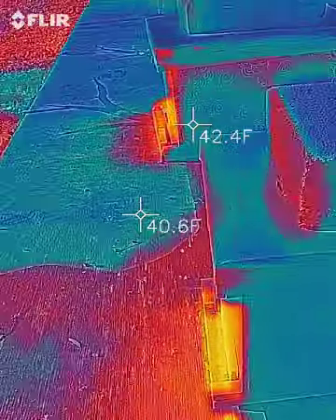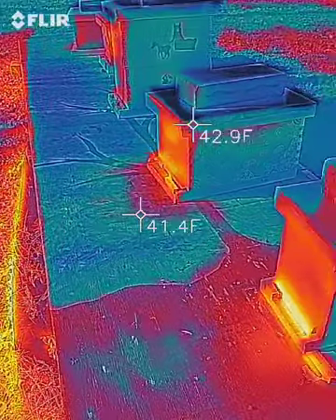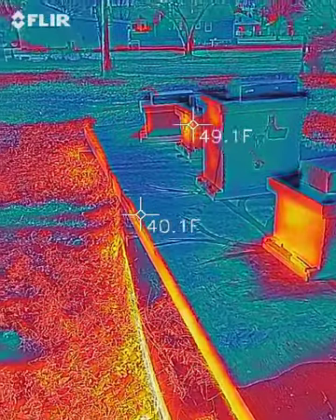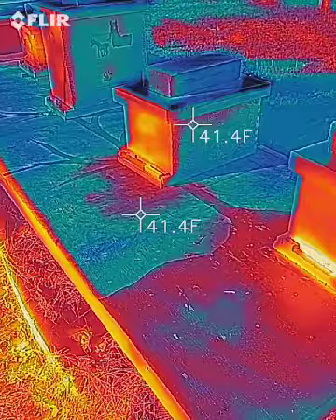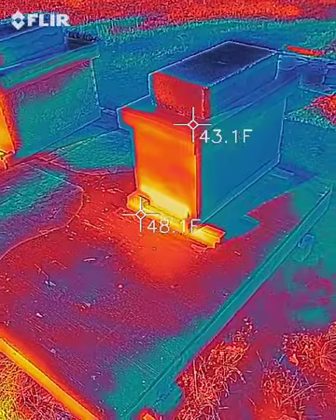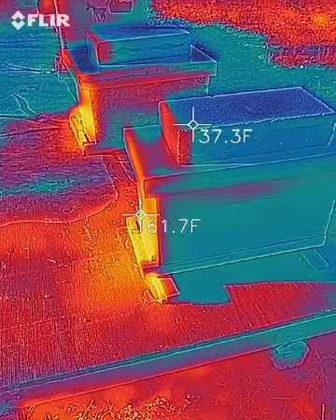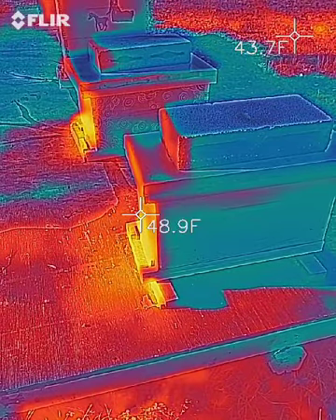If you end up getting this, we have the FLIR 1 — it just attaches to your cell phone, which makes it super simple. The version I got comes with an extendable battery so you don't run out of battery before you're done recording. I started out at 100% and within 7 minutes I'm at 77%. It's definitely helpful on snowy days when there's a lot of reflection, but you can calibrate it using one button — it just auto-calibrates. You set it up where you want it, hit calibrate, and it will use its software to get rid of that extra refraction, kind of like what you're seeing off the grass, because the grass is wet today and all that sun is reflecting.